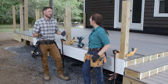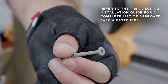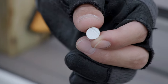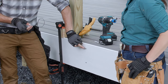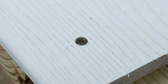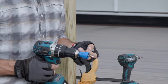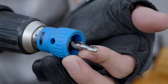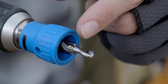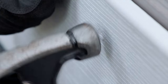We have two main fastening options: two types of fascia screws. The first option uses a fascia screw paired with a composite plug — color doesn't matter much since the plug covers it. We pre-drilled four holes, which is much easier to do with the fascia on sawhorses rather than clamped in place. This uses a specialized two-stage bit: the first stage drills a hole larger than the screw shank, and the second sets a recess deep enough to fit both the fastener head and the composite plug.